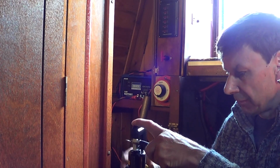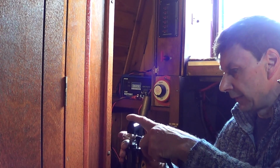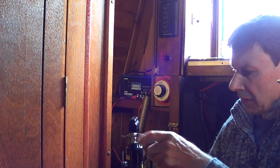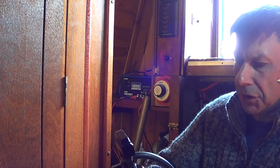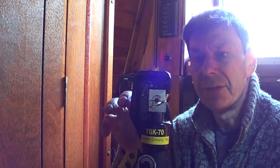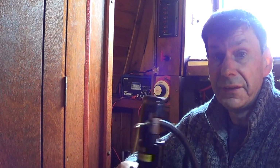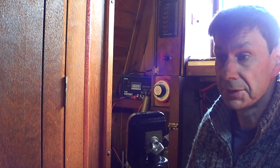When you get it to a point where it starts to grip, you can reposition yourself a bit. If the fitting is sliding out a little bit of the end, and then I think we're starting to grip now. Then the idea is you do it as tight so you can't see any gap between the two metal inserts there. You don't want to see any light through those, and theoretically that should be tight enough, and you should have crimped your cable on there.